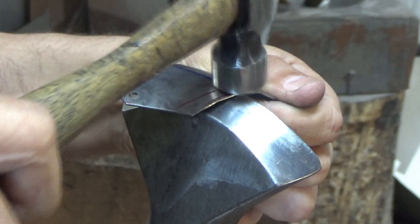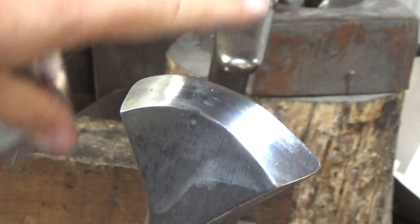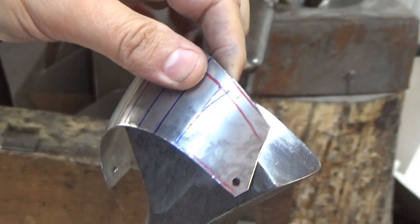A common mistake that's made with these, and I used to do it all the time, is that these really are just light catches. If you check out some pictures of originals, they're not great scallops like this, or very rarely are they great upturned scallops. They tend to just be little catches for the light. They're a lot daintier than we imagine. And just work the other side.